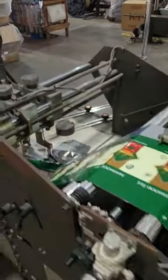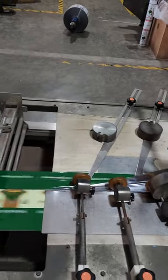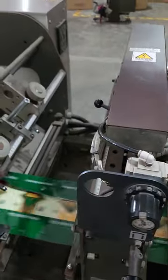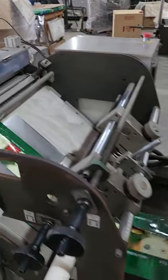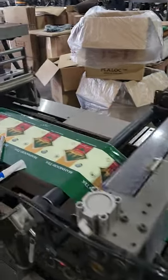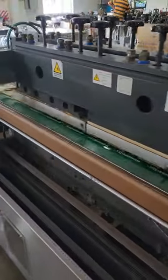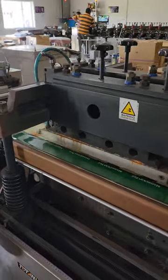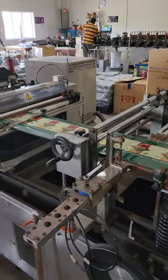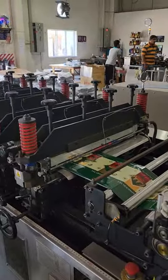At this point the bottom gusset gets folded and the folding takes place in this unit. Once the folding is done, it goes through a little bit of sealing where the K 45 degrees are marked. And thereafter the film goes through another series of sealers here. The sealing is very precise because you have about eight sealing points. A Totani seals, then cools, then seals, then cools — and there is a repeated amount of this taking place to increase the seal strength immensely.